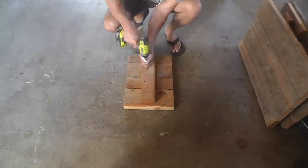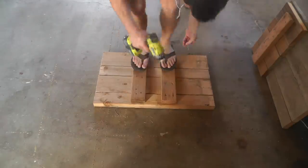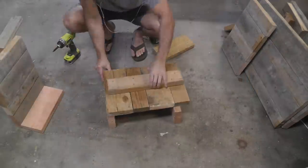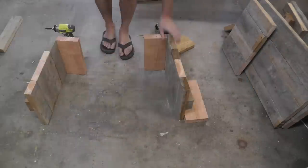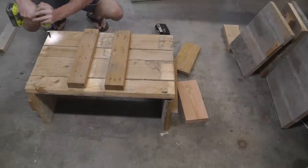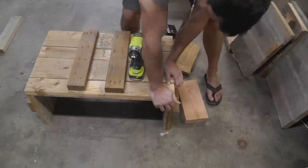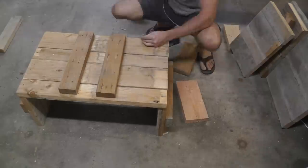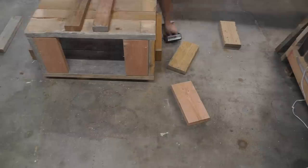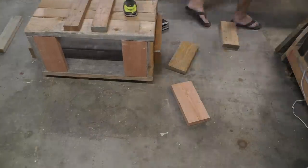For the formwork I used the same wood I had used previously for the concrete fire pit. I made wall panels out of 2x4s and 2x6s and then screwed them together into boxes. I was planning on using 4x6s for the seat of the bench, so I used some 2x6s to make notches in the concrete that would accommodate those wood beams.